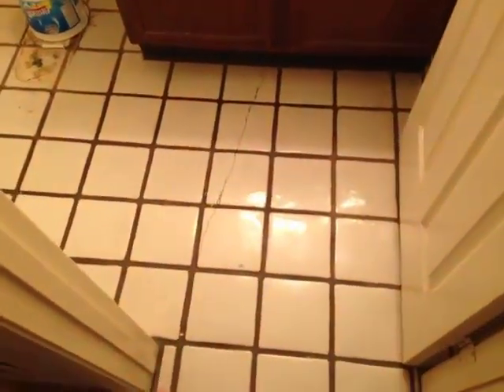There's another little bathroom with some Mexican tile through here. You can see the cracks that came through here. See where the crack came through this tile? I can already tell that the installers never put down any kind of an isolating membrane, and that's why this has begun to crack. With all of the cracks in this floor, there's going to be quite a bit of membrane required.